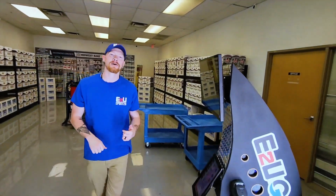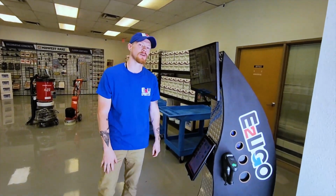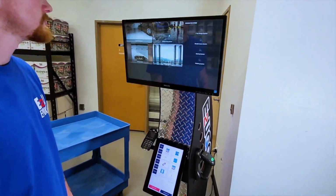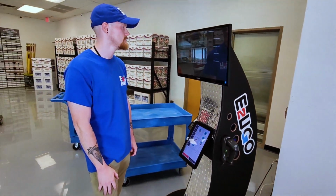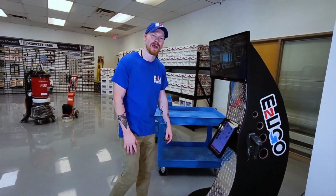Now I'm here today because I'm doing a one-day flake system for a garage. So let's find out all the product I'll need. For a typical 400 square foot 2-car garage, you will need 1 2-gallon kit of 6150 RC, 2 boxes of flake, and 2 1.5-gallon kits of polyaspartic ultra. Awesome, you heard the man. Let's go grab it.